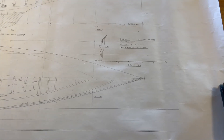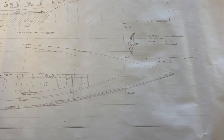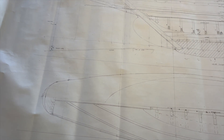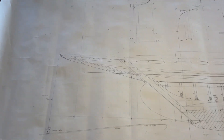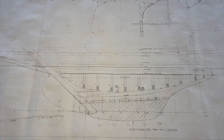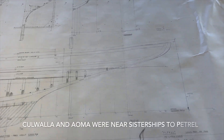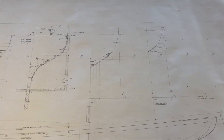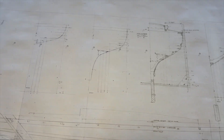We did address this issue. At Simon Siddurban's suggestion, we got David Payne, a well-respected naval architect, especially in this genre of boats. He came in and took the lines off Petrel as she is now. We discovered the boat was in pretty good shape because we did have the line drawings of both Ioma and Kalwala to compare it to, as we don't have any original drawings for Petrel. However, this showed that there was some sag in the stern of Petrel.